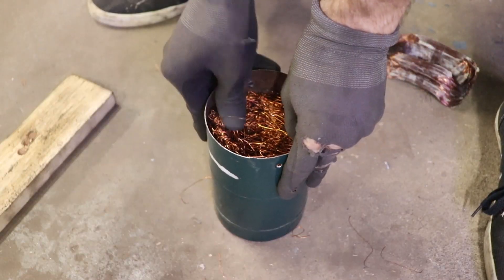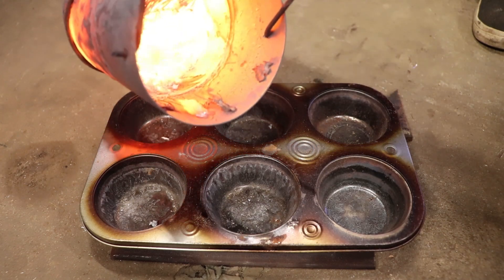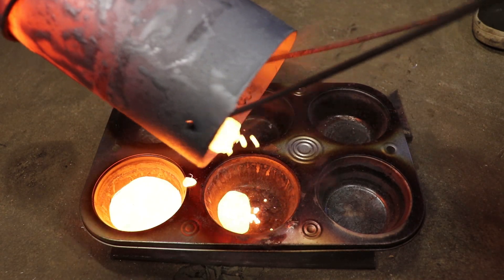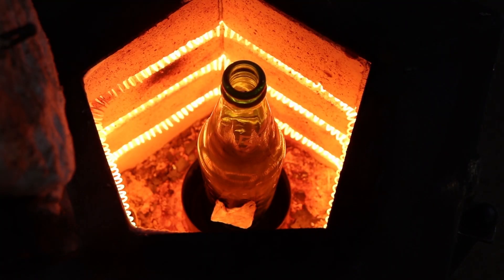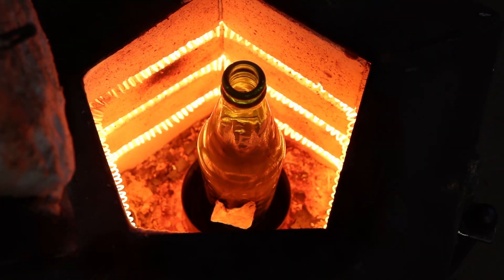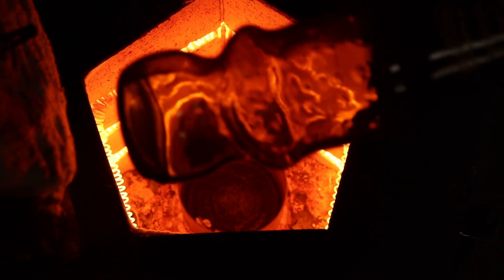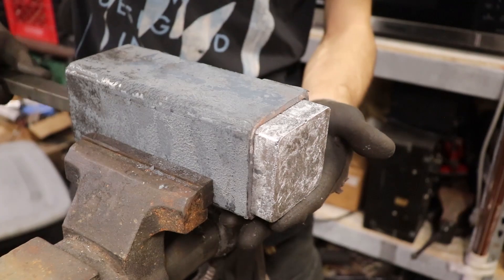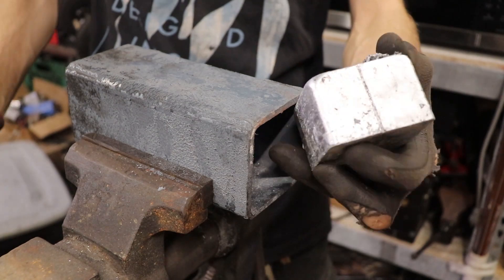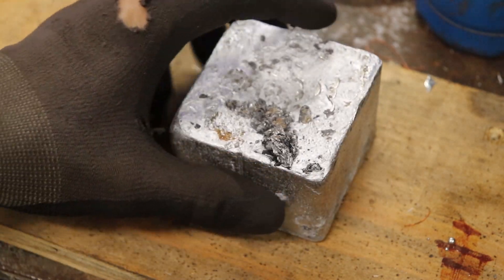I got some aluminum and copper ready and did some pours. I'm still learning what fluxes to use for these metals to increase my yield. I kind of messed up on the copper pour because the copper wire I tried to melt had a lot of impurities and even some aluminum in it, which all came flying out when I tipped the crucible. As a final experiment, I wanted to see if I could soften up a glass bottle to reshape it, so I put it in the furnace with the cover off. Within 15 minutes I could see the bottle tilting to one side as it collapsed on itself. Going back to the aluminum — I hammered it out of the steel tube, and it's impressive how it captured the weld seam of the tube. The fact that it's a big square chunk makes it really nice to put on a CNC mill.